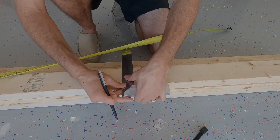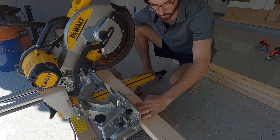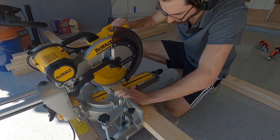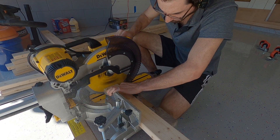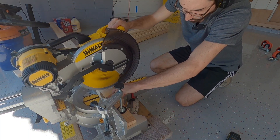At this point in the process, I wasn't sure how long I wanted the bench to be, so I only cut out the eight leg pieces that would get screwed into L's and the four width pieces that I decided would be 38 inches. One piece would connect the legs on the top and one on the bottom for both sides of the table. I also set up a stop block to cut out the four 5 inch bottom plates.